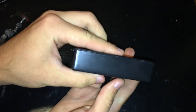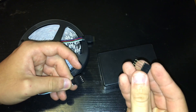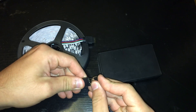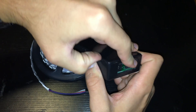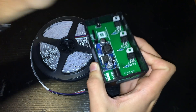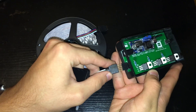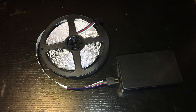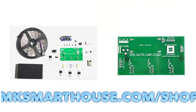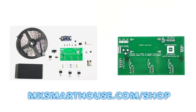Now let's move on to the LED strip. Take the 4-pin female header with long pins and stick it into the female side of the LED strip. Remove the lid of the case and connect the LED strip — the white wire should line up with the W mark on the PCB. That's it for the hardware. All it needs now is software, which will be covered in the next video. If you need any of the parts, you can buy a kit or the PCB at the link in the video description.